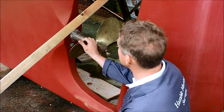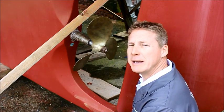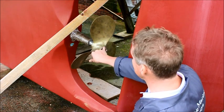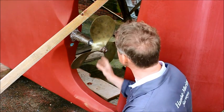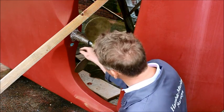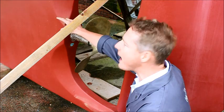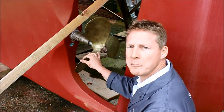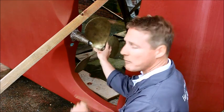What we're seeing here on this particular vessel is a three-blade yellow metal propeller. We don't know exactly the composition of the metal here but it's likely to be a bronze alloy. It's secured to the shaft with a nut, and in this particular case there is a split pin that passes through the nut. On other craft the securing of the propeller may be different — it may be a folding type propeller. This particular shaft passes into a stern seal which then passes into a tube terminating in a water-cooled packed stern seal at the rear of the engine compartment.